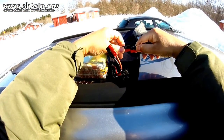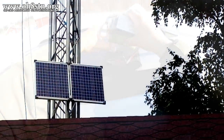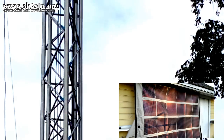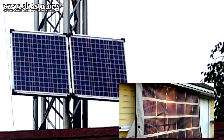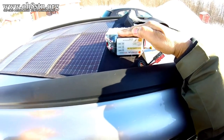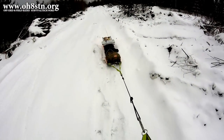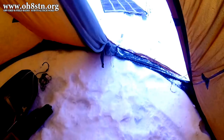I don't have a lot of test equipment for testing lux or solar energy, but what I do know is when my panels are producing power, how much power, and if they're not. Some of you may remember I have some monocrystalline panels up on the tower, connected to a PWM charge controller in the shack — those are my benchmark. On my test rig, the amorphous panels with the Genasun charge controller start charging earlier, with the sun lower in the sky, than my monocrystalline panels. I attribute this to the low-light capabilities of the amorphous solar panels and the maximum power point tracking of the Genasun charge controllers. We should also remember I'm at 65 degrees north, and sometimes even at 66 or 67 degrees north — there isn't a whole lot of light up here, but the combination is working.